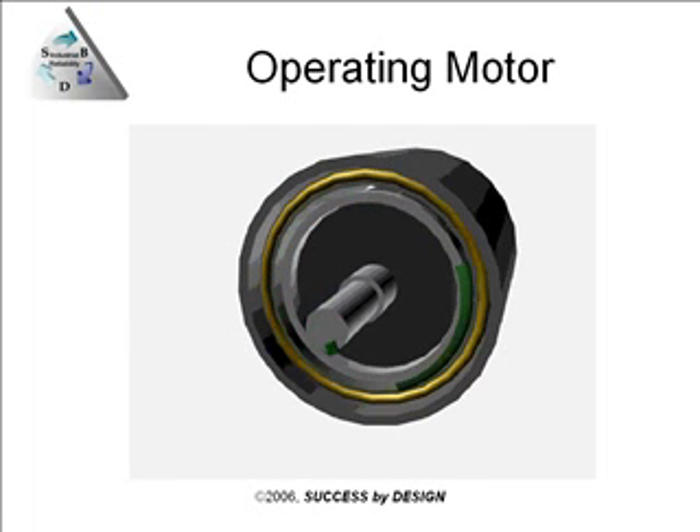All together, you end up with a system. What's really neat about this motor system is the electrical signature. If I were doing vibration analysis, I would put my vibration transducer above the bearing, which is attached to the shaft of the motor. What I'm measuring in vibration is movement within that transducer of a little piezoelectric cell, which generates a little current, amplified and sent back to my vibration analyzer. In electrical signature analysis, you are actually using the electric motor and the air gap between the rotor and the stator as your transducer.